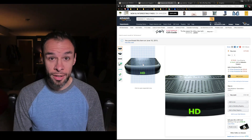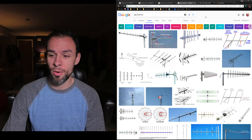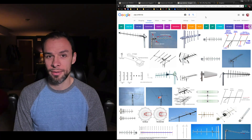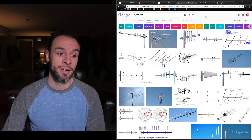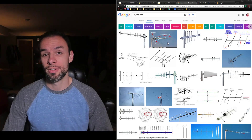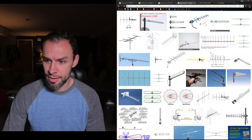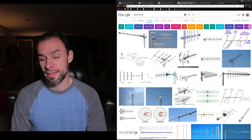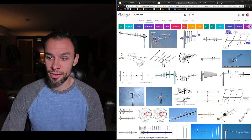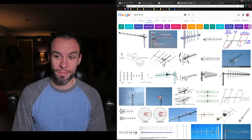If you're in the city you can pick up 50 or 60 channels, and most shows you care about — football games and so on — will be on those five networks. I am in the woods and I tried those flat leaf antennas you can get for $50 at Best Buy or Walmart, but I had no luck — I only picked up a couple of channels. Finally what I had to do was buy a Yagi antenna — that's a style named after a Japanese inventor. I have one mounted in my attic.